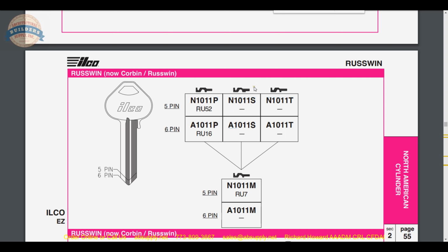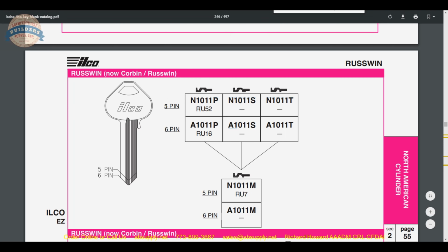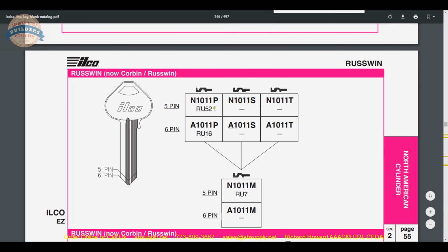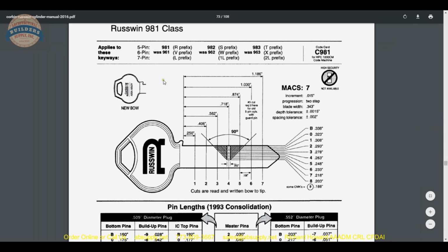The T keyway won't even enter the S cylinders. The owner walks around with the all section blank and can pass the house and the garage. So that's a standard application. Not only will the key not work, but it won't even enter the cylinder. And that's nice because it's quite clear that you're not meant to enter those doors. So a bit esoteric on a deep dive of where you would use multiplex, but I think that is an entire explanation of the system.